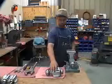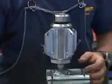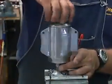Start the overhaul process by removing the head from the shaft of the tool. Look inside the head for any debris that may have gotten lodged in the jets.